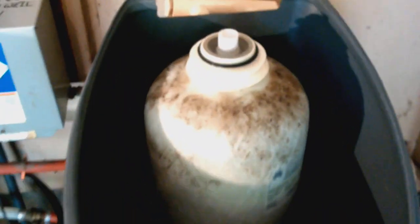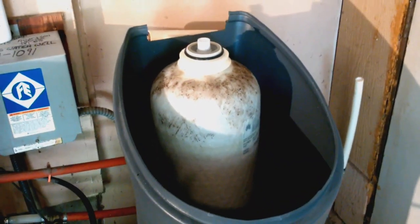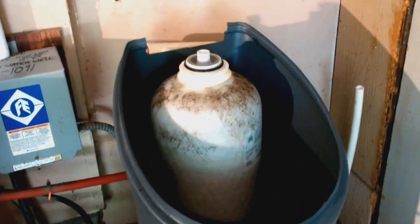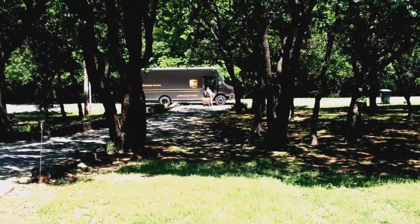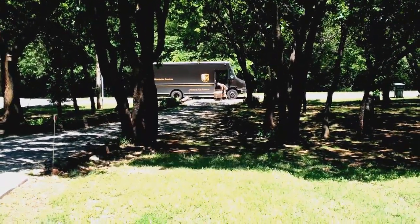I disconnected the overflow tube — there's an overflow tube back here — so that we would be able to pull out the whole water softener unit. There's the resin tank, and I have a feeling it's going to be pretty heavy. So I'm going to exercise a little bit of strength and pull out the water softener and put it into the driveway to shake out the old resin. I'm just now taking the resin out, and look what's coming — ordered by Amazon is the new resin, and there's a UPS guy coming in with the resin right now.